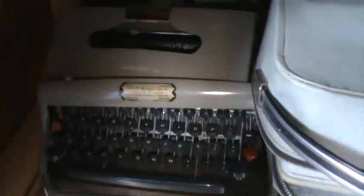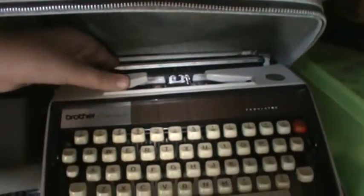That was in 2012, and I accidentally closed that account off, which I didn't mean to do. Then my third or fourth machine - I did a really bad buy. I spent $25 on a Royal HH, which in the first place is a really high price for an unrestored machine. When I got it, the escapement was also pretty destroyed. Somebody actually whacked the machine from this side of the carriage so hard the escapement broke off on the inside - probably dropped with the carriage to that side. So it destroyed the escapement, and the carriage return lever had broken off, so that didn't work anymore. I spent $25 on that, which was pretty bad deal.